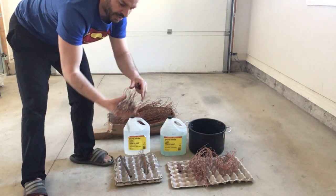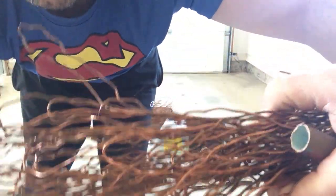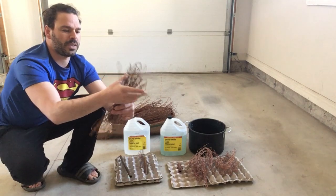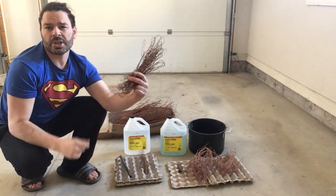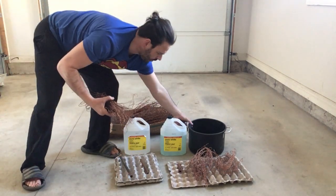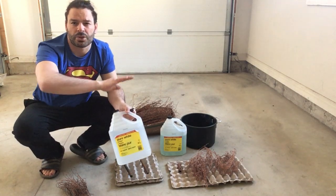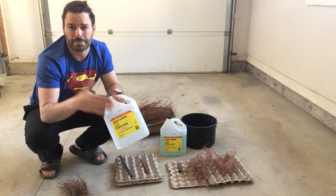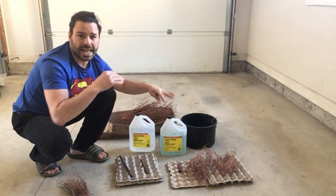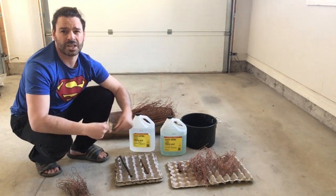For this experiment, it was very easy. All I did was I took a handful of number two copper — as you can see, it's very tarnished, there's a lot of discoloration, and there's also a stickiness to it. It's almost like there was glue or the paper had some type of wax filament on it. So I was wondering if the vinegar would dissolve that as well. I took just a handful of wire, put it into a bucket, and poured the vinegar on top of it, making sure it was fully submerged. The vinegar cost $1.29 for the jar. I have seen some people put vinegar and salt into the pot — I don't think it really matters; I think the vinegar being your acid is the important part.